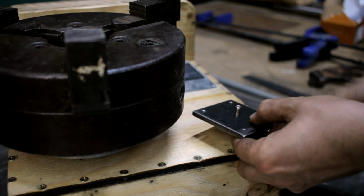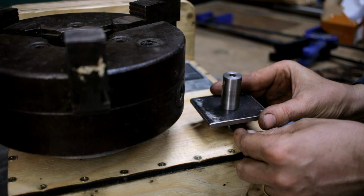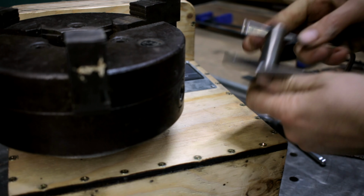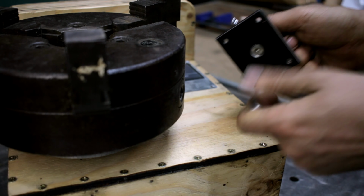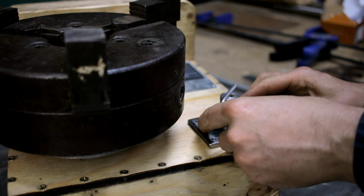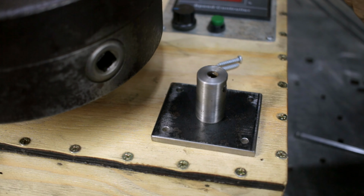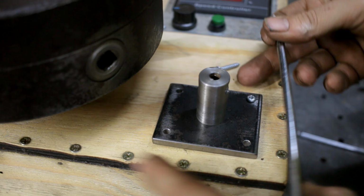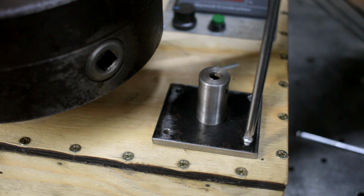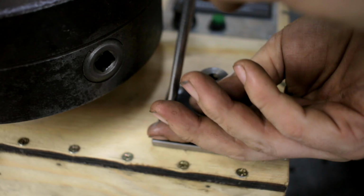The final stage of this build was to give me somewhere to hook an earth lead, and I basically copied what I did on the first one, which was to run a copper braid around the aluminium pulley where the belt would have run and hook it up to this little post, which has an M8 hole tapped in the top that accepts a cap head screw that can just clamp down on the copper braid and keep it tensioned. The system worked really well, and it never gave me any problems on the old one. So I thought, well, I'll use that again.